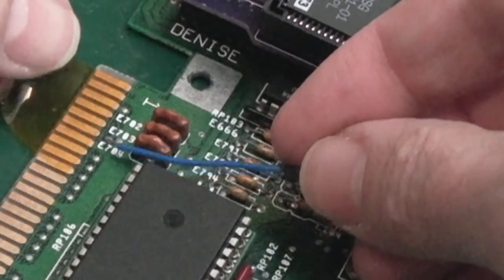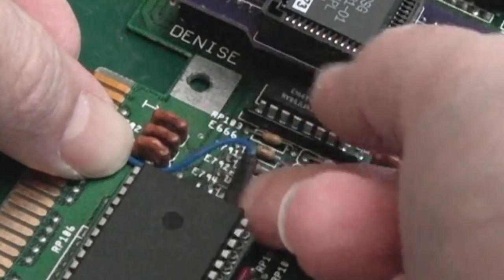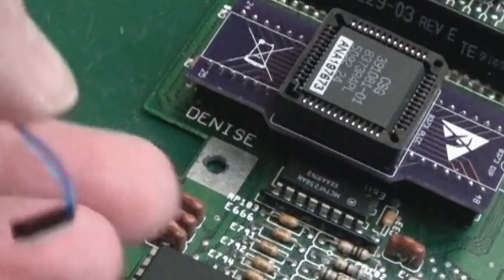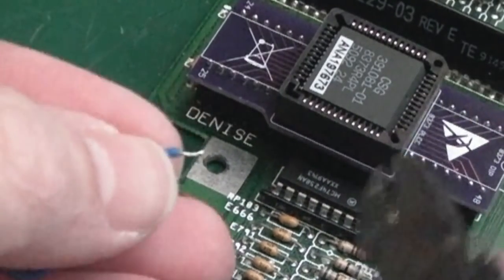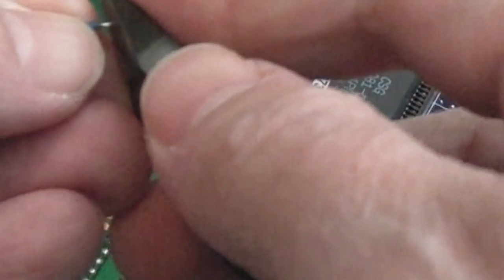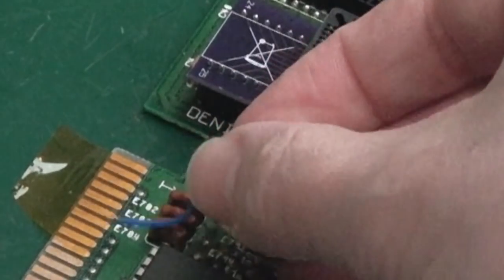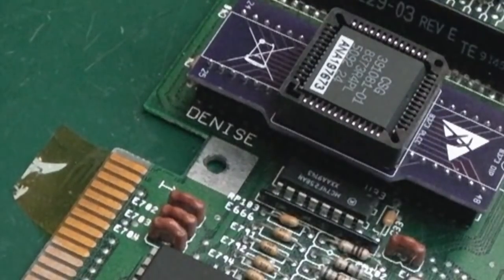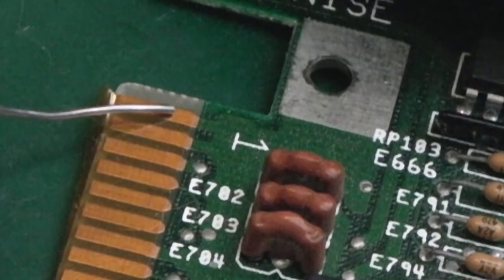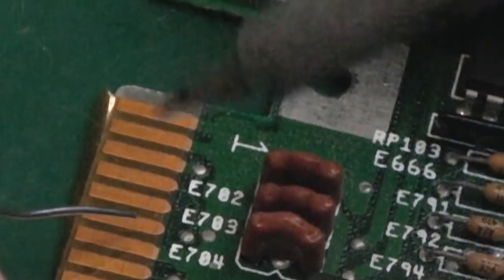And it's just going to go from down here and bend around like that. So we'll do the bending bit in a minute. We don't need a really long bit exposed there because it's going to be a really small join. Bear in mind, it might not be very reliable in terms of bending and stuff like that. Let me just count these again. It goes 1, 3, 5, 7, 9, 11. It's pin 11.